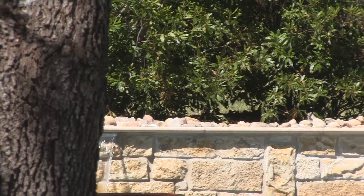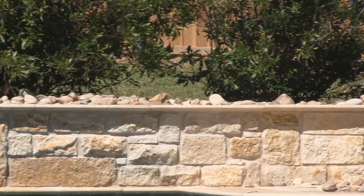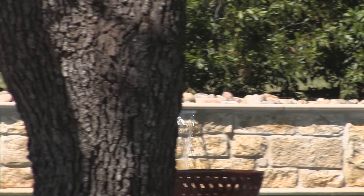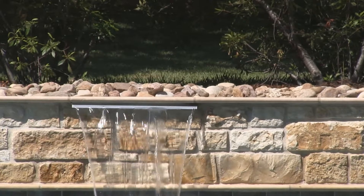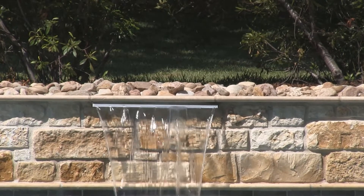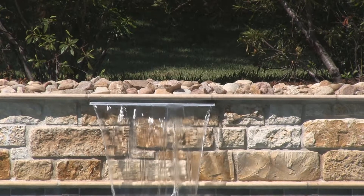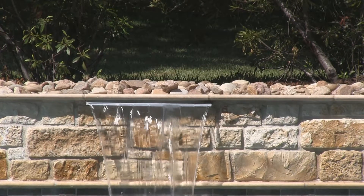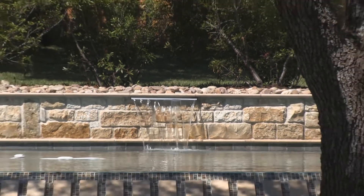Because the downside of this pool was wanted to be an attractive water feature from the lower level patio, we took a material that matches the coping and the wall caps — a honed and filled travertine bullnose — and we cut pieces of that travertine and placed them on the weir wall, which allows the water to sheet between them and create all the different sheets.